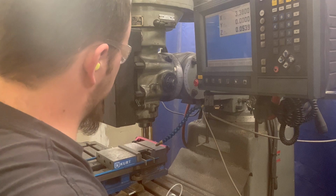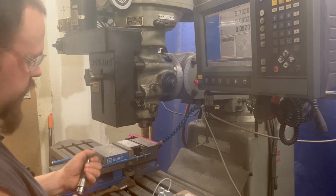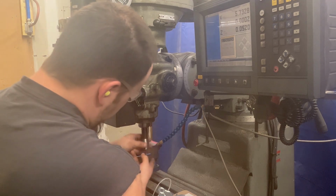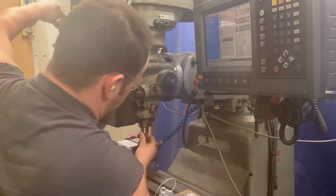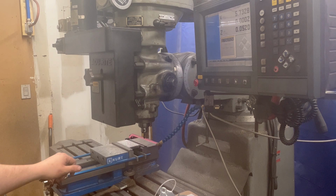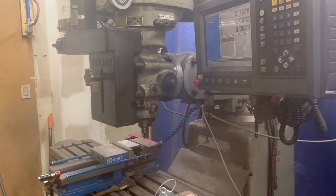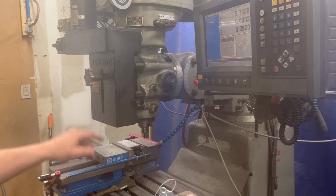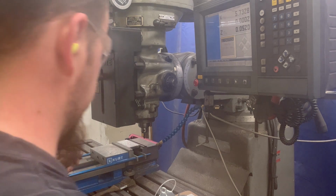Turn the spindle off, break it. But I actually grind a flat in the mill. Just a tiny flat. But that keeps your Z height the same, because with this machine, that's critical. You have about 5 inches of travel on your Z, and that's it. I will be replacing this with a CNC bed mill one day, if not a machining center.